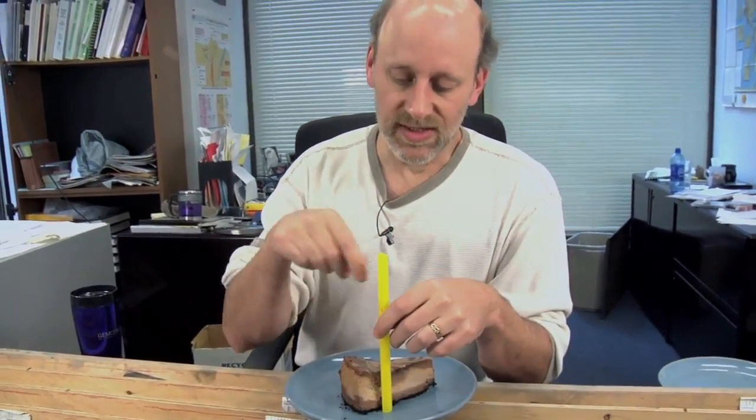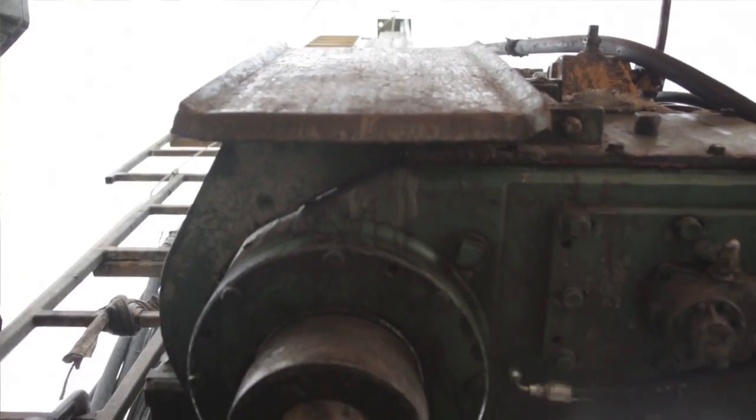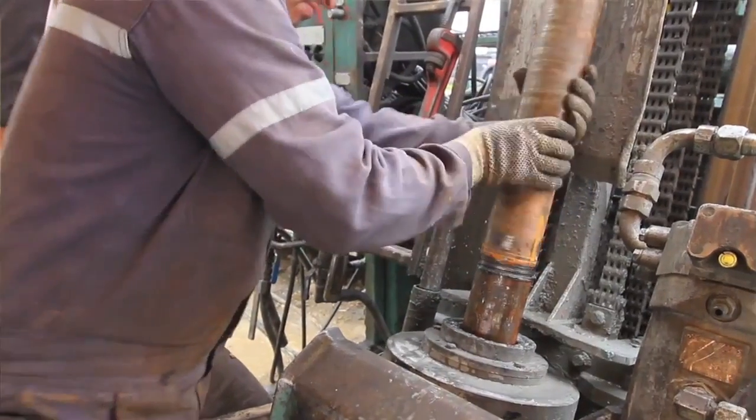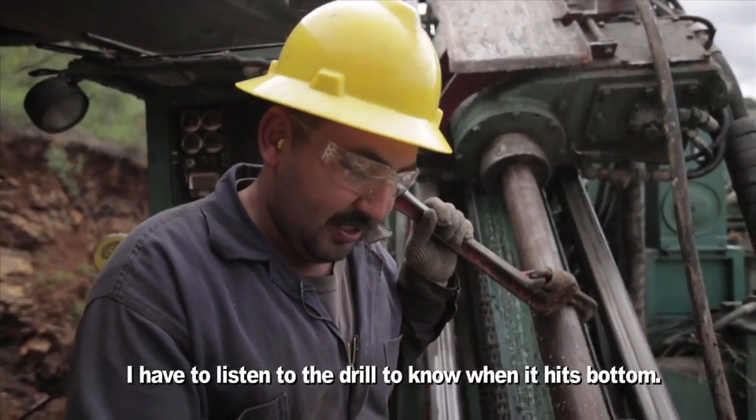The outer tube goes down into the earth, and the center tube is pulled out. That way you do not have to keep pulling out all of these every time — if you're 300 feet down, that's very time-consuming. With the drill itself, there's a big chuck on it, which is like a vise. It closes on the drill, pulls it up, held by another vise, slides back down, and pulls it up again. That's then screwed into a whole series of pipes. As you drill through the rock, the core feeds into those pipes. After you've drilled something in the order of 10 feet, or 3 meters, you'll pull that rod up with the core in it.